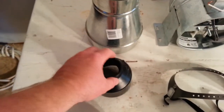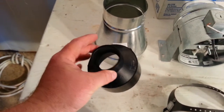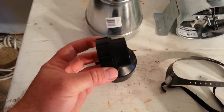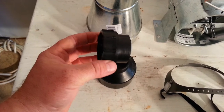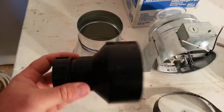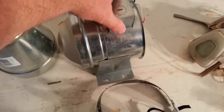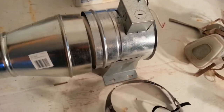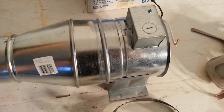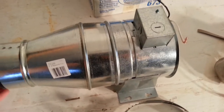The fitting at Lowe's — a GVL 0040 — is a six-to-four reducer. I also have a three-inch to two-and-a-half-inch reducer, which is an ABS reducer. Then this is a threaded street fitting that goes inside of this — it just happens to fit almost exactly inside — and you end up with this setup right here.